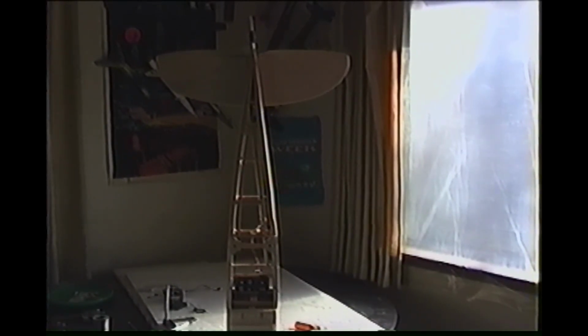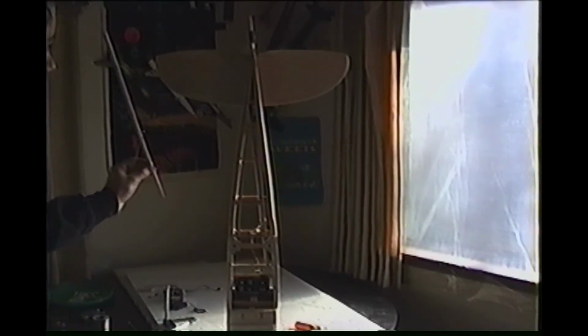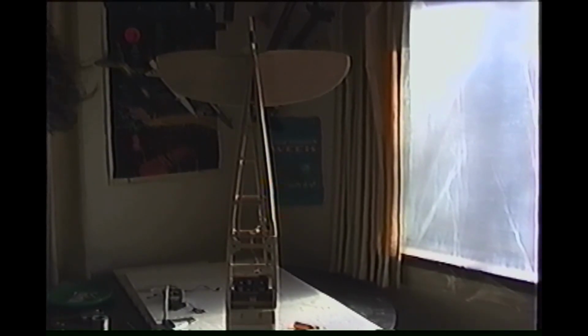Keep it at neutral. Usually just put a stick across it or whatever. Probably go off the vertical off the top and just square it up. And then do a little tweaking in here to get this rod down to my outboard servo in order to run that without any kind of a preloaded condition. You don't want to have any drag. You want to try and get no drag whatsoever on any of your rigs, because all you do is steal from reaction time of your servos and eat up your batteries.